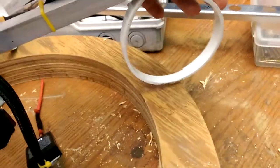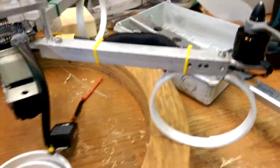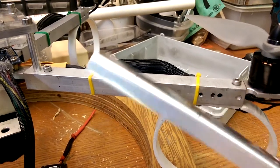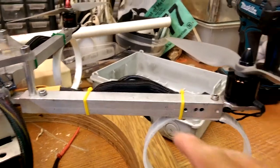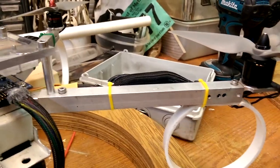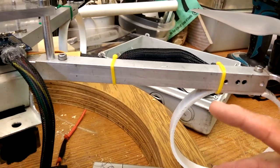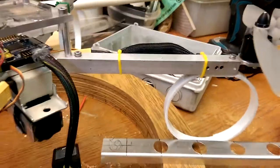I need to replace a couple of the landing gear — slash training wheels — for this thing. I'm trying to figure out if I can make some sort of landing gear out of the original frame and have it articulate down and out of the way like a two-bar linkage that you could pull to extend the gear down. A two-bar linkage pulling in will open up the scissors and push a landing gear down, so they'll fold up inboard of the propellers.